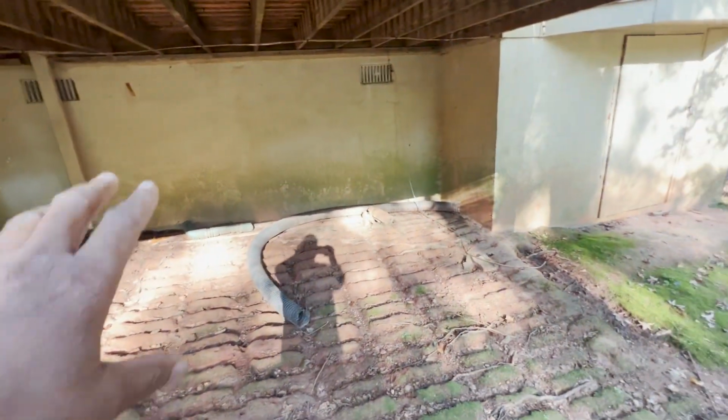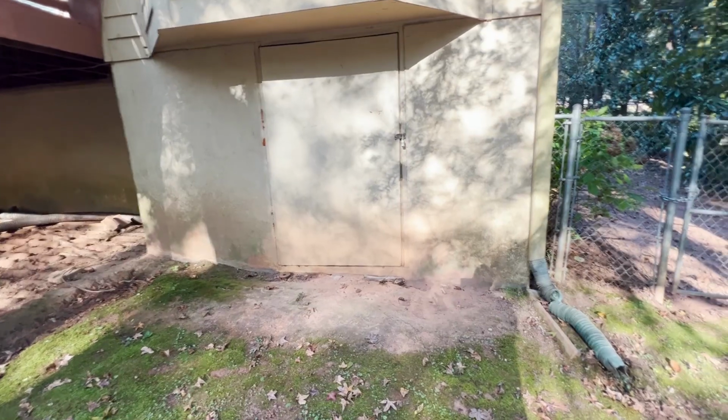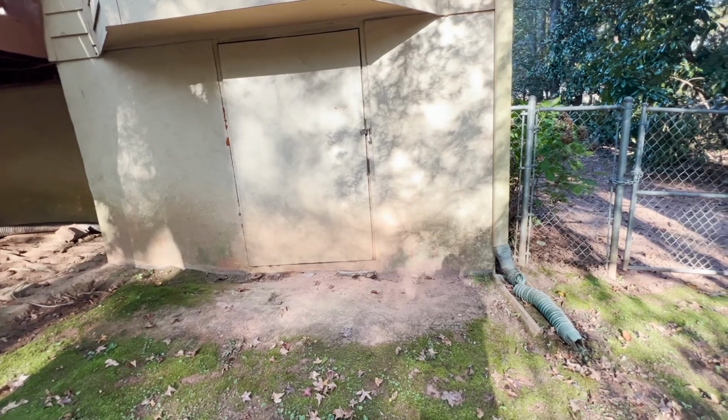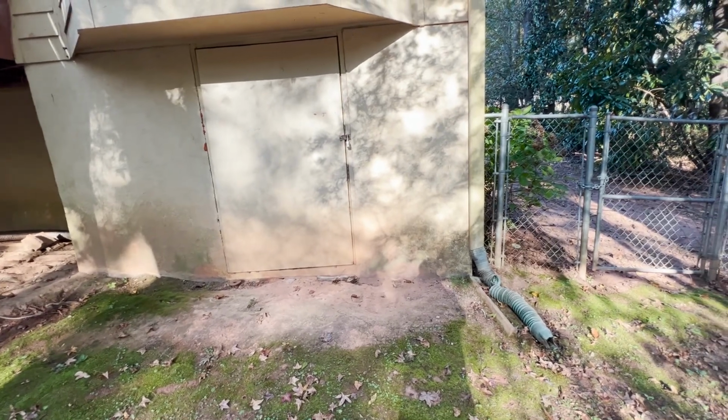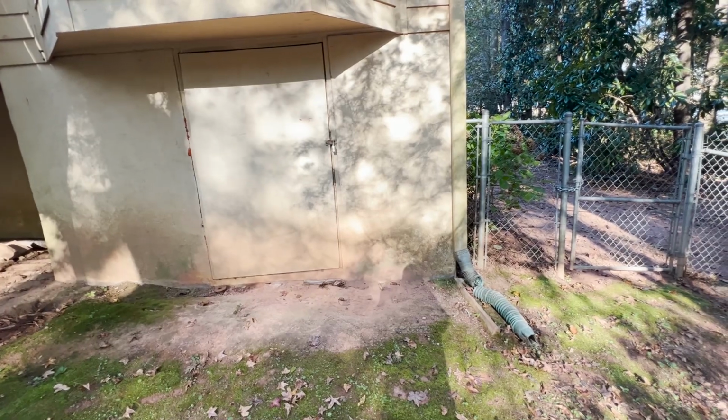Again, we still have mold. A lot of green algae and stuff that's on the side. We're gonna try to get all that off. Again, we have red dirt. We're gonna try to apply the chemicals. This is stucco. We don't wanna use high pressure. So what we're gonna do, we're gonna try to make sure that the chemical do all the work for us. We wanna make sure that we don't use high pressure on the stucco, but we're gonna try to get it off the best we can. We're gonna use the J-Rod to do a soft wash when we do the rinse.